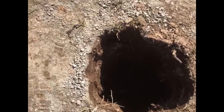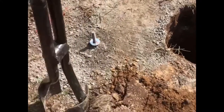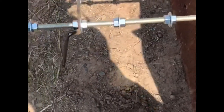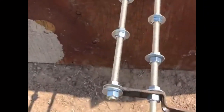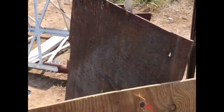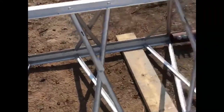So what I did is I dug this hole — it's three feet deep, about 12 inches across, and I'm going to put five more bags of cement in there. Because I need to anchor it to something, I came up with this custom anchor. These tabs will grab the cement a little bit better, and the bar at the bottom will be embedded in the cement. This is the template I used to put the other anchors in, with bolts coming up out of the board so I'll have something to anchor to. Five bags times 60 pounds — 300 more pounds of cement in the ground holding that 150-pound plate down. It should more than take care of the weight of this antenna.